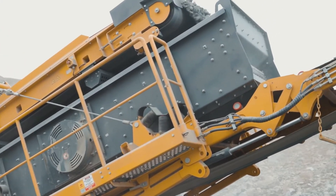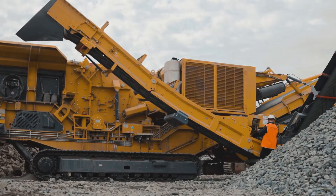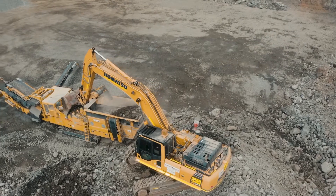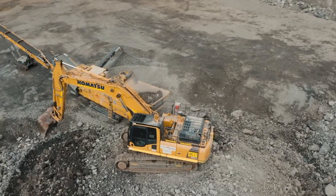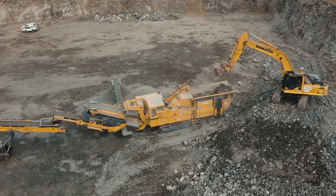This negates the need for an additional screen and the costs that accompany that such as transport, fuel and maintenance. All bearings where possible have been removed and replaced with head and tail drums with sealed bearings — no requirement for daily greasing.